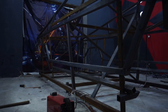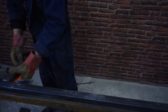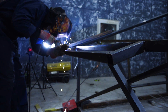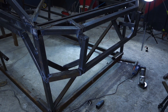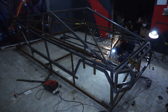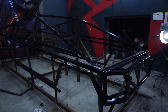I finished with the side elements and moved to the front frame. This part also delivered me some hassle, and I worked on it for a few days. After that, we need to weld everything through and smooth out so that the welds can't hinder metal adherence. I covered the frame with anti-corrosive paint, because after welding the sheets it'd be impossible to do so. Some minor parts of it will burn while welding, but it's just the way it is.